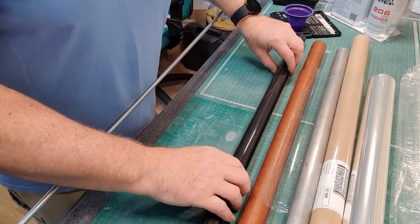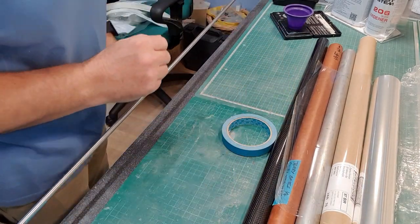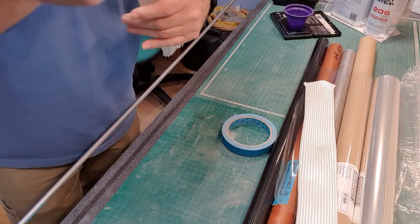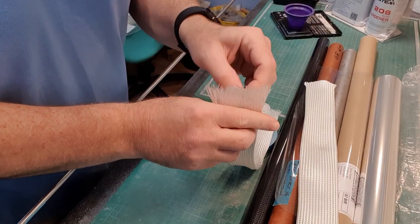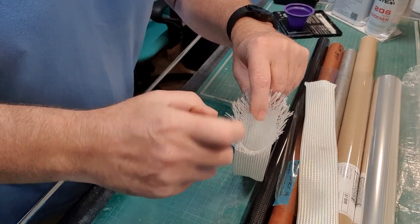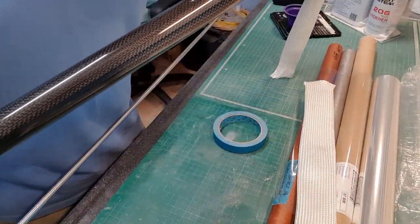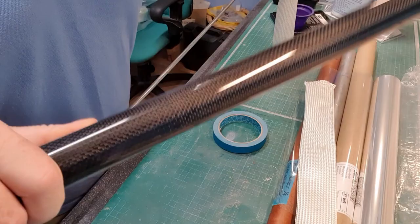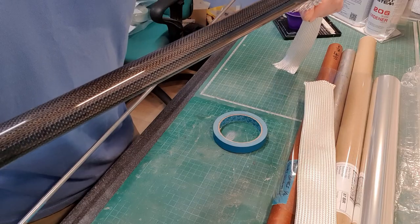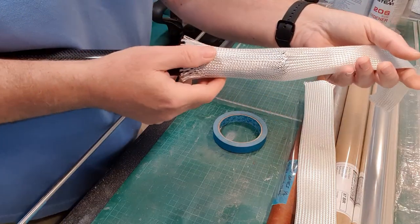And then you lay over the top a very specific sort of glass fibre. And let me show you some. You can actually get glass fibre in a sort of a tube or a sock. And there's the end of it. Yeah? And what you do basically is you put the cellophane on the bit you want, you put some release agent on this tube just in case. Then you wrap it in cellophane, and I'm not sure how we attach the cellophane yet. I'm thinking about that. Then you slide this tube over the cellophane, being very careful not to snag it.